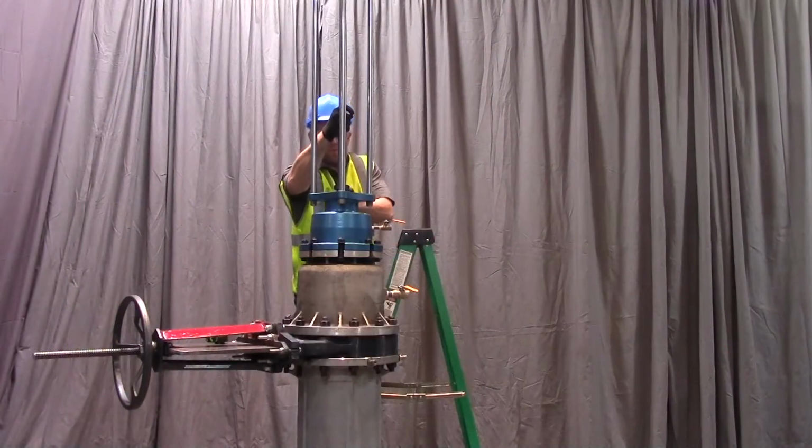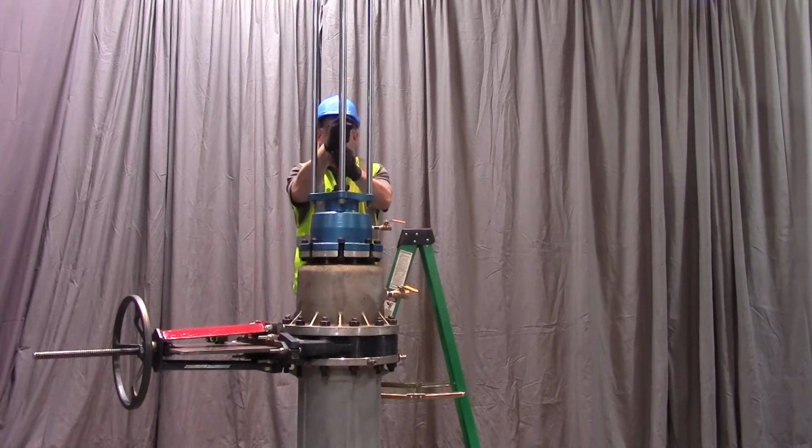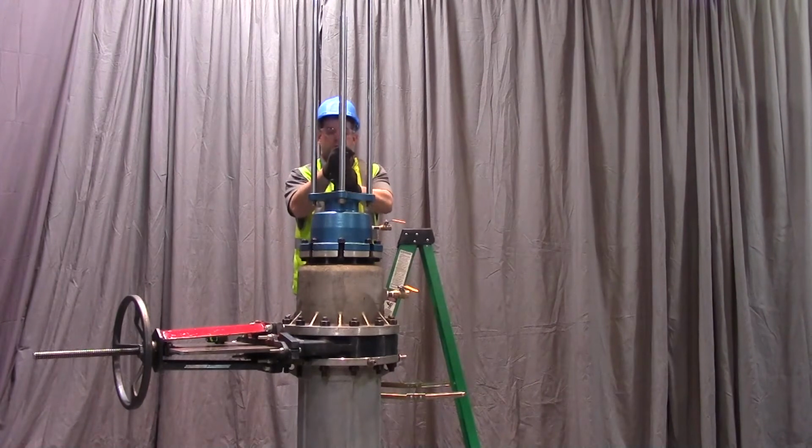Hold and control the exposed saw mandrel, loosen the packing nut assembly clamp lever, and slowly lower the saw mandrel down until the cutter is resting on the center top of the pipe. Ensure the shell cutter spins freely in a clockwise direction.